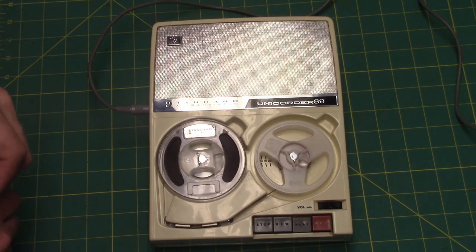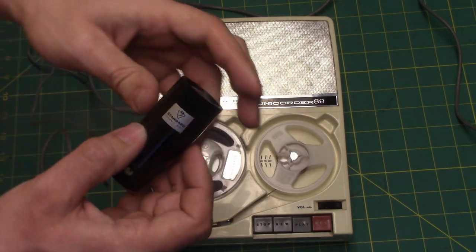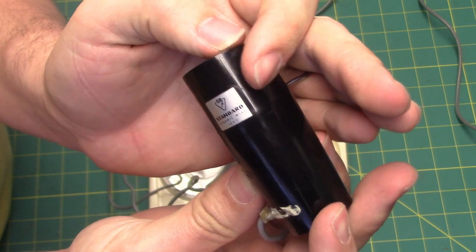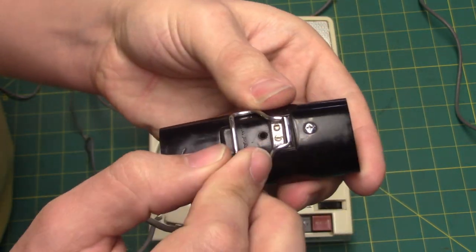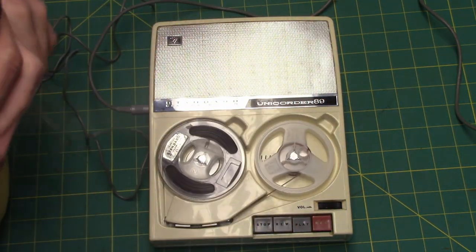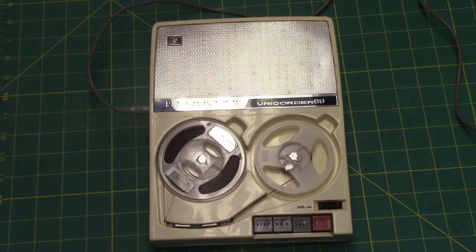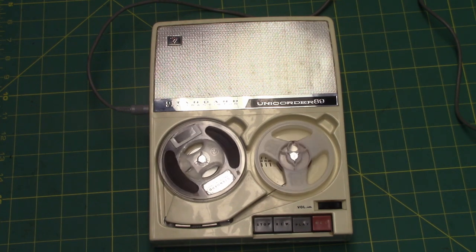The original microphone this recorder uses is 10 kilo-ohm impedance, which is incredible for a dynamic microphone. It has an interesting sound to it, though already with this machine's slow speed, and its pre-emphasis being as strong as it is, it will sound really crazy on this recording. This machine also uses automatic level control.